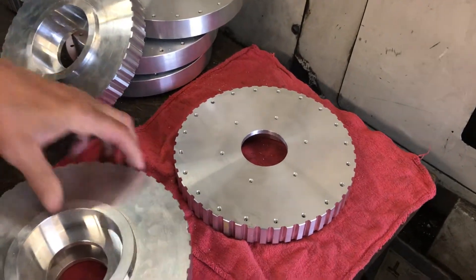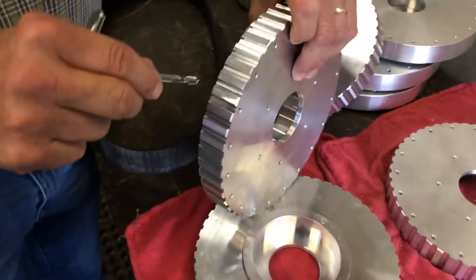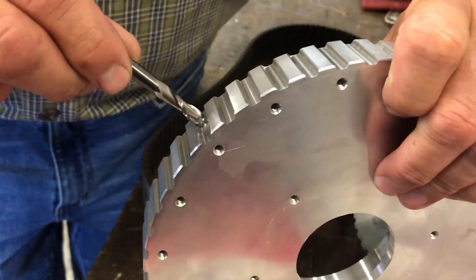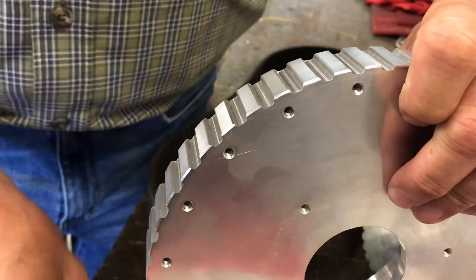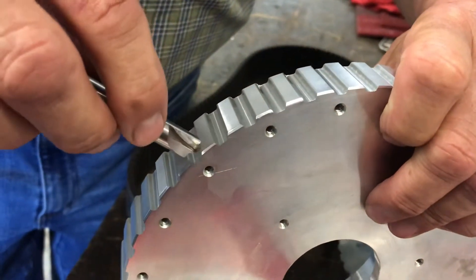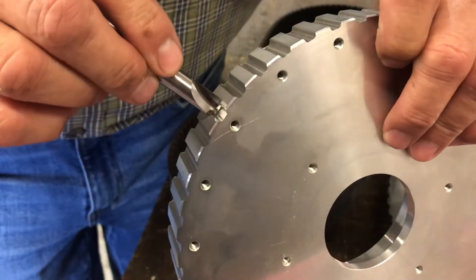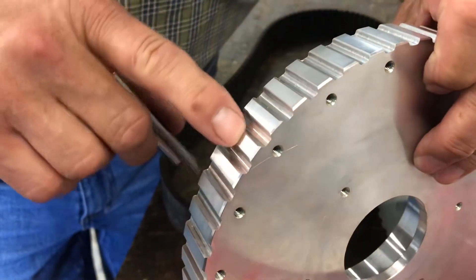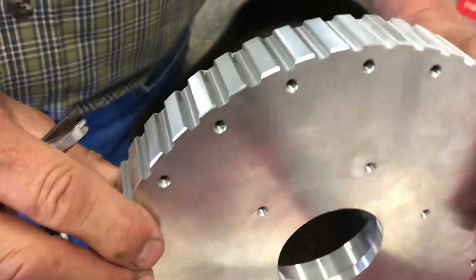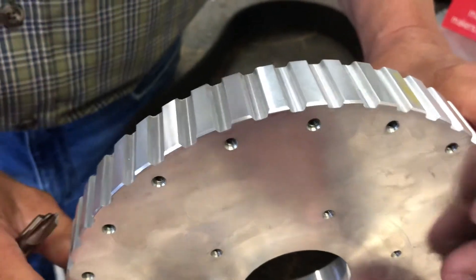What we've done here — you can see it — we started out with a ball end mill to rough out a good portion of the material, and then we made a cutter that goes in and cuts the final shape of the tooth. So we're getting a nice blend. There's a radius in there, no sharp corners. You don't want to tear the rubber belt, so we've got a nice transition from the OD all the way through that tooth pattern.